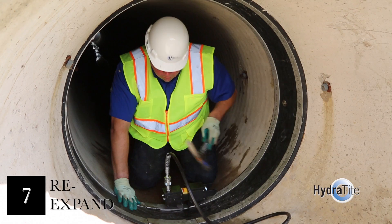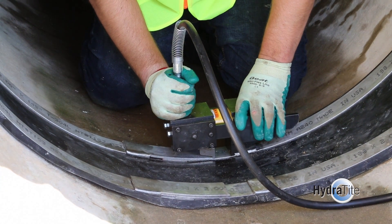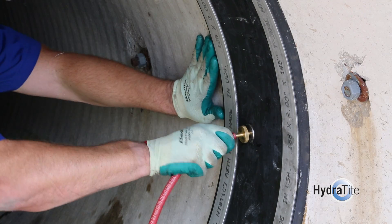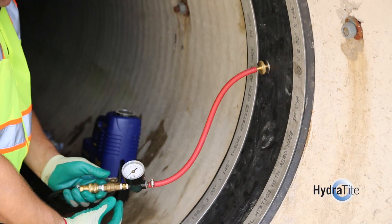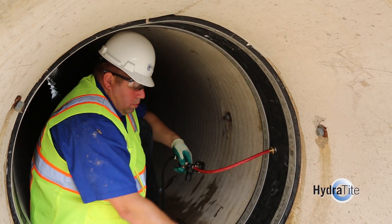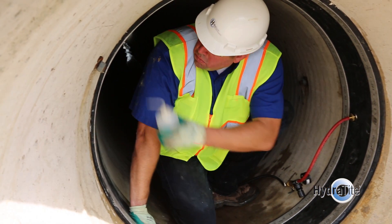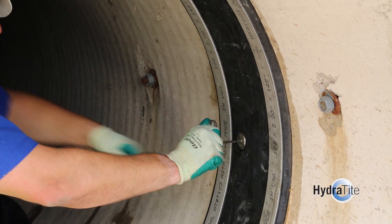The seventh step is to expand the bands after 30 minutes, because the rubber may flow or creep, causing the bands to relax. If, after re-expansion, the gap size has increased for the wedge, a larger wedge must be installed. Remove the small test plug fitting located in the test valve, and insert the threaded connector and hose attached to an air supply. Pressurize the back of the seal to 5 psi — the seal should expand outward or balloon. While the seal is pressurized, use a solution of soapy water to spray around the edges of the seal to detect any leakage. On the rare occasion leakage is detected, determine the cause and fix the situation, which may include additional surface preparation and re-expansion of the seal. Remove the test hose, depressurize the seal, and replace the test valve fitting.